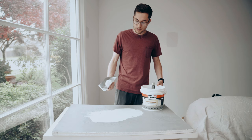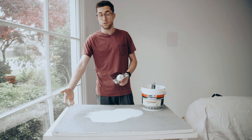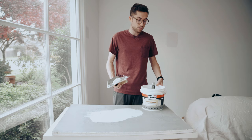Once you're used to how it spreads, I would typically practice moving from left to right. I'm right-handed, so I move from left to right so I can work back into my plaster. If you're left-handed, you probably want to work the other way. You always want to work from dry to wet — always working back into your wet plaster. This center part was just to show you what it looks like, but we're going to move this off to the side and start on the left side.